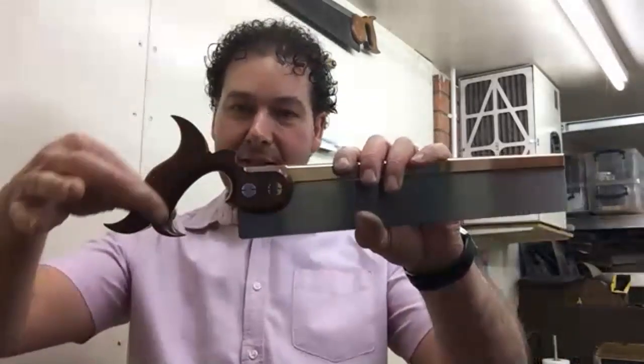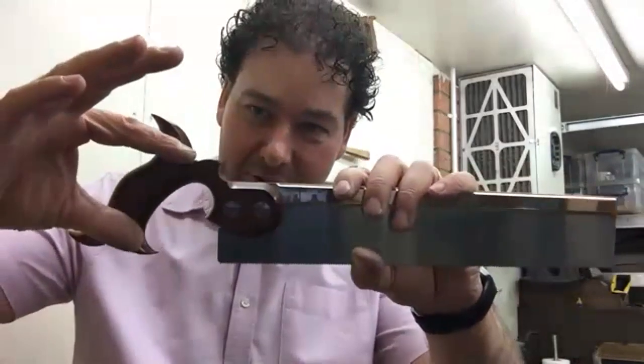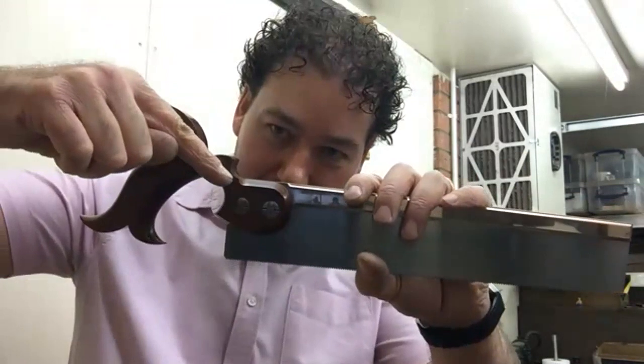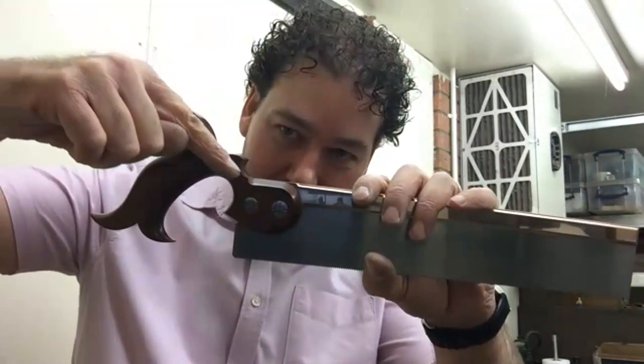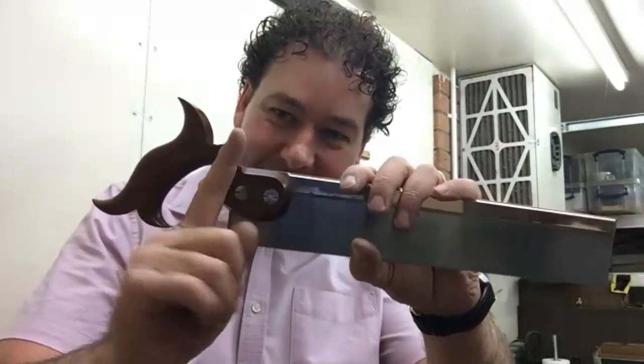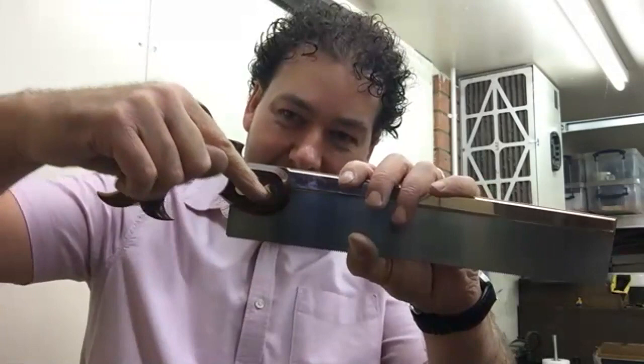What I said earlier was we try and use quarter sawn as much as possible. One, that's over strength. It also gives a pretty appearance to the wood. A lot of woods look better quarter sawn, but it's mainly down to the shrinkage. If this handle expands and contracts, it's going to do it this way, so the grain's going in this direction. Through that weakest point, the grain isn't like that, where it could snap. It's passing through in this direction.